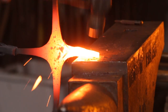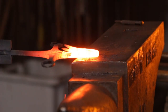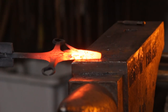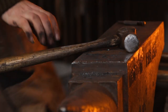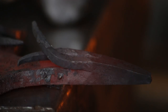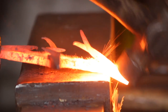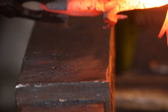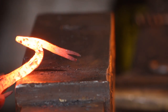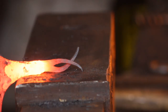As you can see on the drawing the heads are very simple — there's no detail on them whatsoever apart from the horns, and they are quite flat as well. The four bull heads on the basket have a lot more detail in them; these ones are literally just folded flat. So here are the heads welded up. The next stage is to take a decent welding heat and just fold those heads over, making sure everything is lying nice and flat and cleanly together.